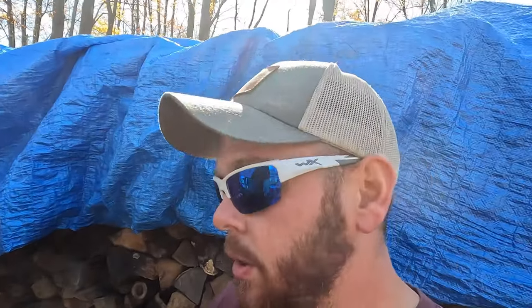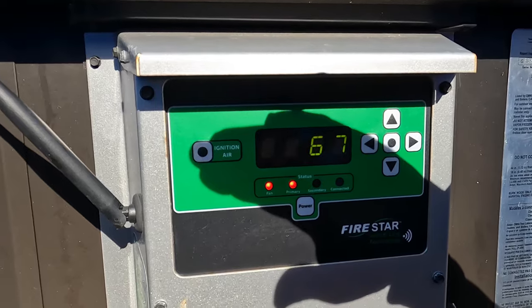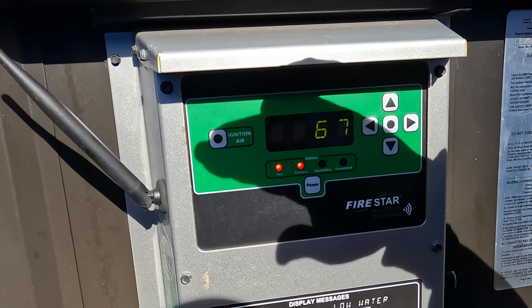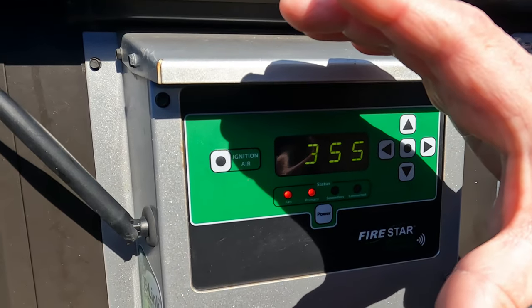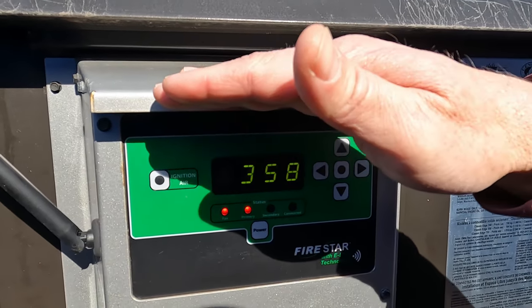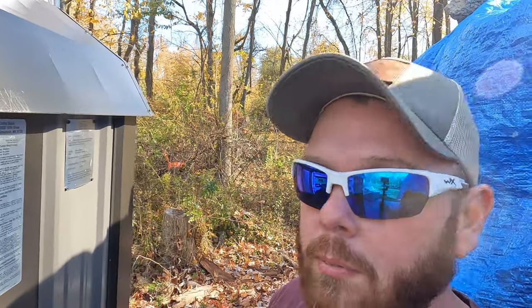This one I can run two pumps and there's still a little room — if I put another small shop up I could run a heat exchanger to it and heat that with the boiler too. On the control panel, you see the LEDs for fan on, primary and secondary. The primary is the air charge for the main firebox; the secondary is the gasification part. The firebox is at 348°F and the water is coming up to 68°F — already up 8 degrees since we started. The gasification process doesn't start until the secondary kicks in around 500°F. At 700°F the LED turns red and we'll get some cranking temperatures. I've had temperatures as high as 1,500°F in the reaction chamber. It really gets rolling with good dry wood.